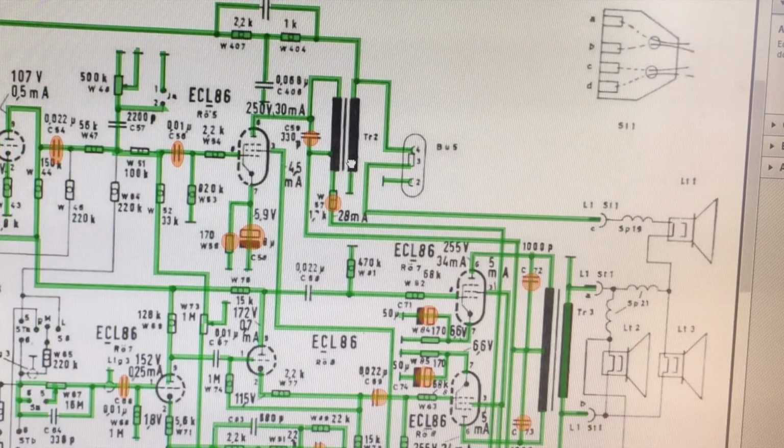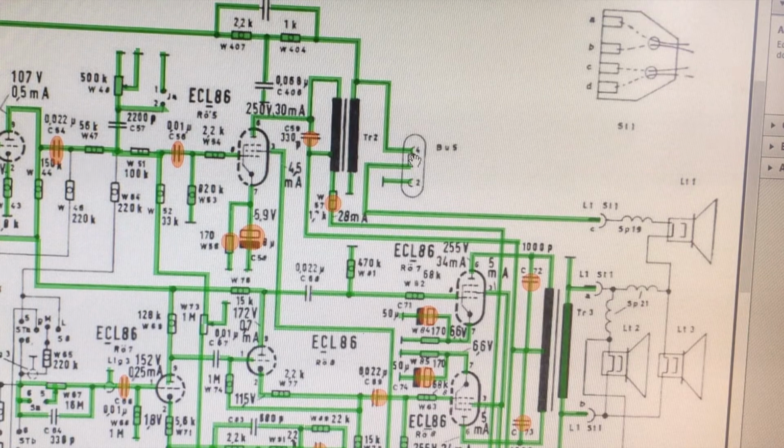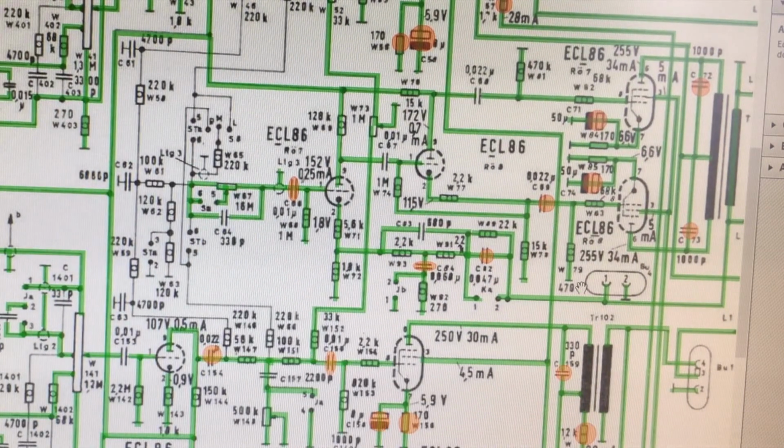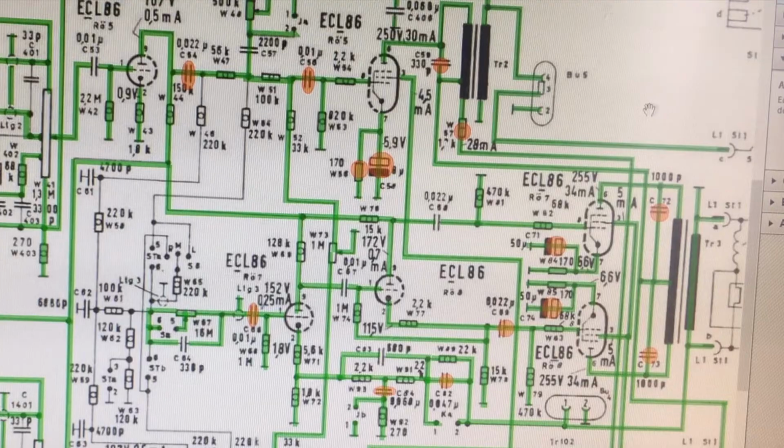And you can see here where this little hand is, that's the disconnect point. When you plug in an external speaker, it disconnects the speaker that you have inside, which is that line over there. That happens exactly the same on the other channel at the bottom here, so I won't go through that. Then what happens is, at this point here,